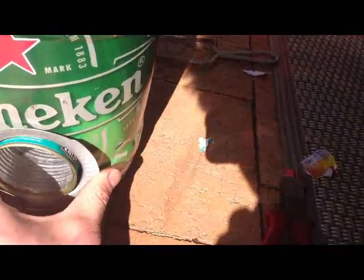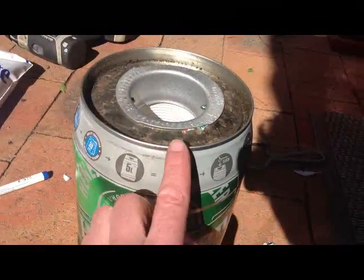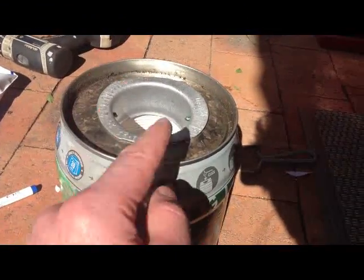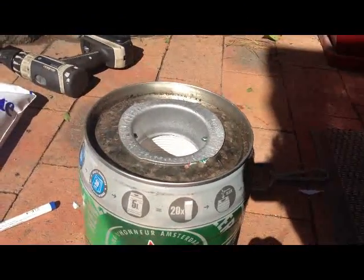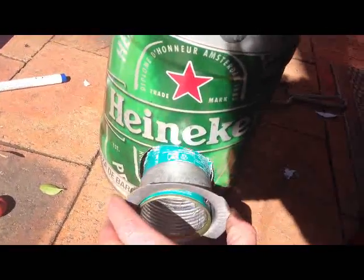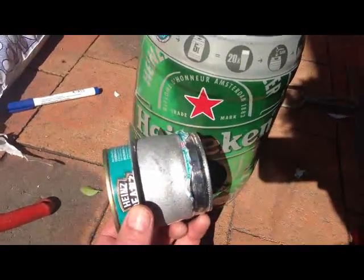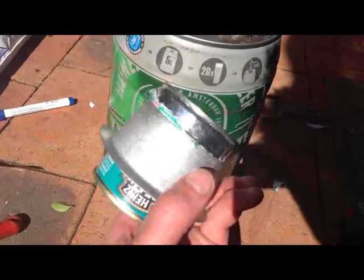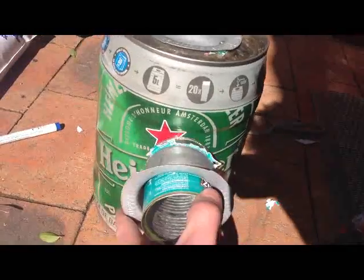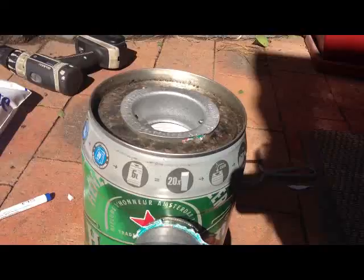Basically that's going to slot in something like that, put a little tray in there, and I'll drill a couple of air holes through the rims, so if you are putting a pan on top there, hopefully it can get some convection or some airflow flowing up through there. So what I'm going to do now is measure how far in that can sits, so it sits nicely within the tube, and I'm going to put a couple of pop rivets through the side in here, and then I'll slide it into place and put a pop rivet or 2 through either side and pop rivet through the top.